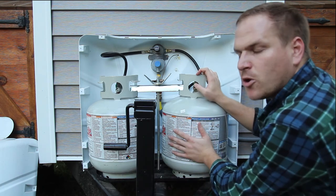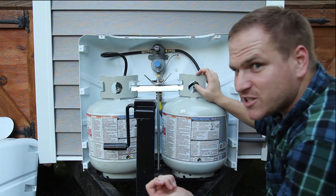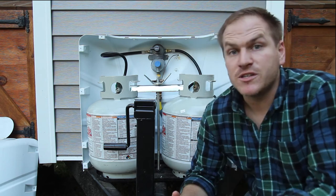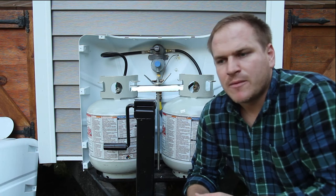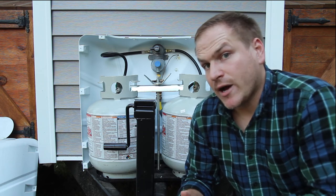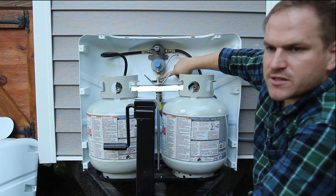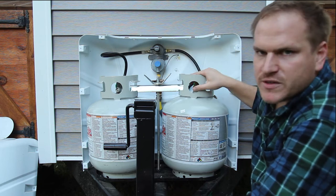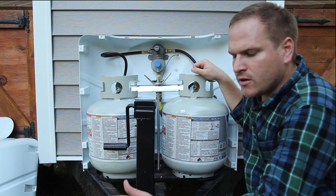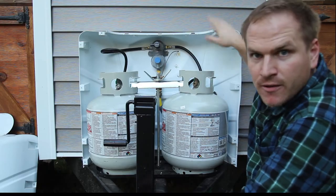That way I can go ahead and refill the empty one on my own time — we'll still be able to cook and use hot water while I'm refilling it at the local grocery store or RV place. Continuous service. You could have one big propane tank but you'd have to wait till it's half full to refill it and lose time, so we've got two. You're probably also wondering what this little copper wire does. If you're using CSST propane line from the tank to your house — that flexible, mostly yellow-coated tubing — you have to ground it. Even if it isn't directly struck by lightning, you must ground your CSST tubing from the nearest point of entry, which are these tanks. I have this copper wire running to our breaker box where it gets grounded. You must, must, must ground your CSST tubing — fires get started that way.